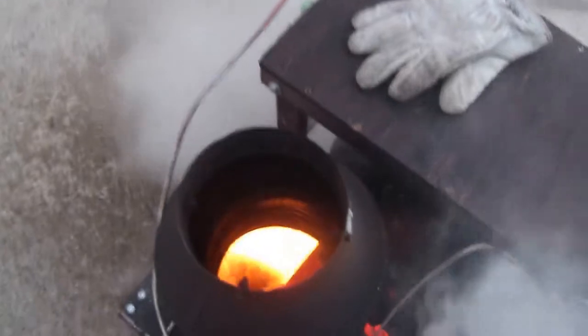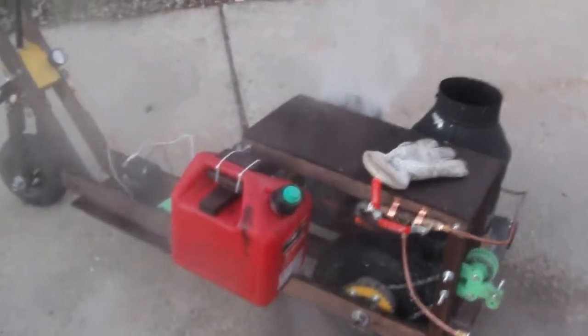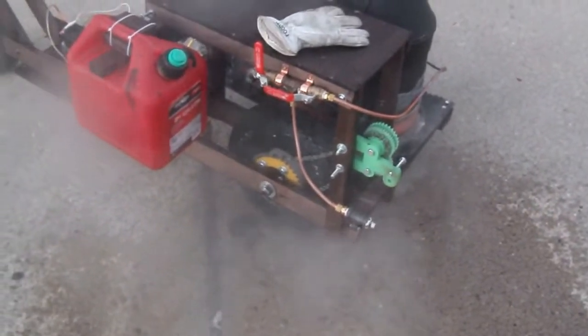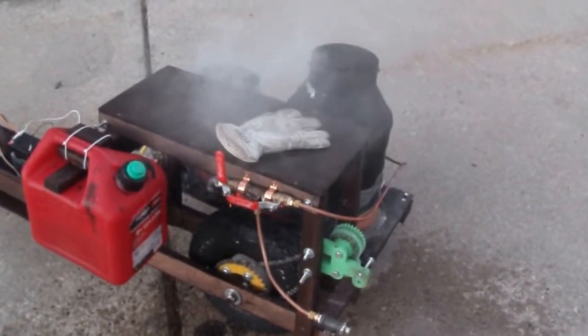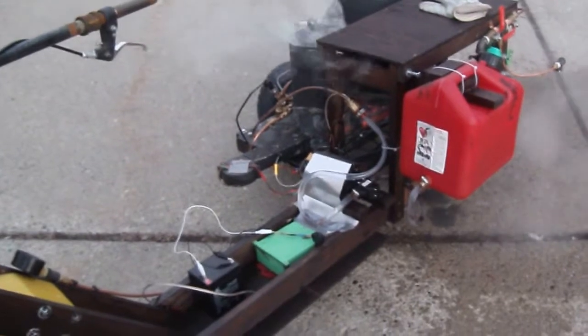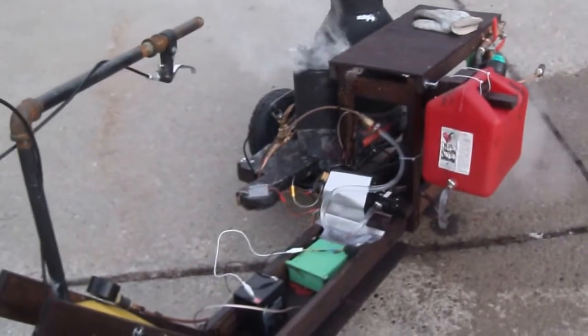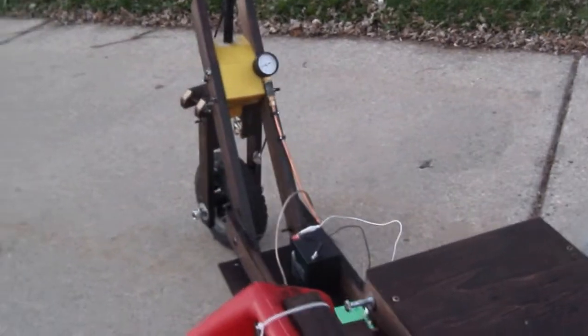You can see it's making quite a bit of fire. This pellet burner was pretty easy to build. What I was about to do is pop the relief valve, which is just a standard air compressor relief valve. I hydro-tested the whole system to around 150 psi, which is actually where the water pump starts leaking profusely out of the seams, but it hasn't seemed to damage it in any way. Let's pop the relief valve.